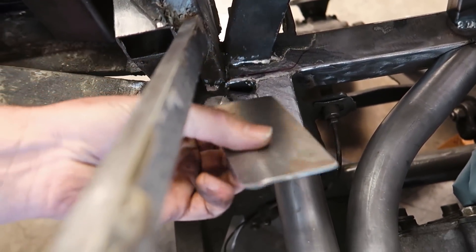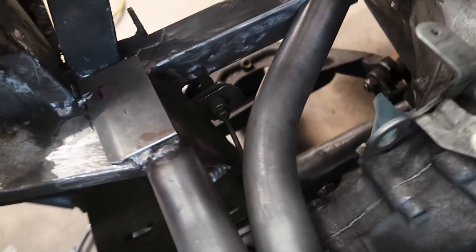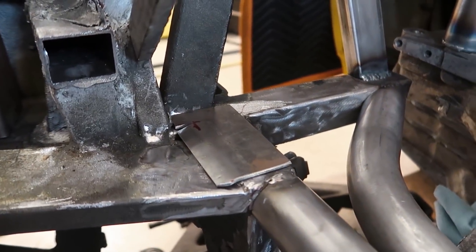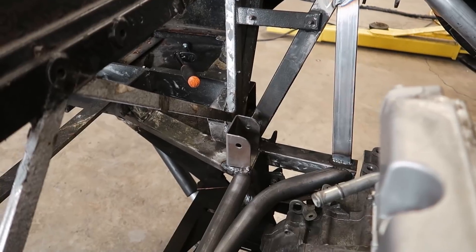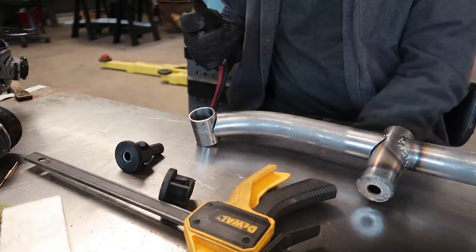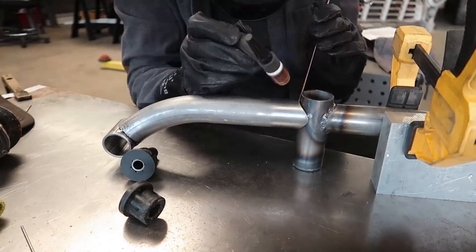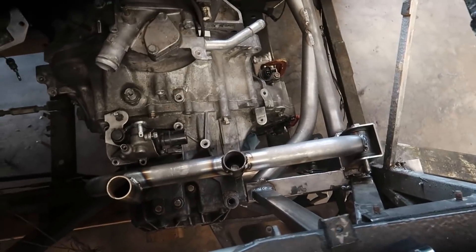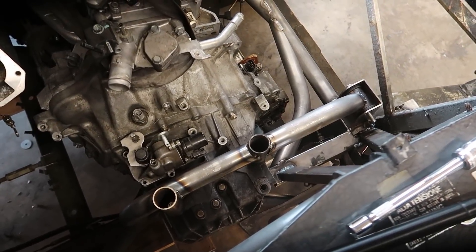You can see where I want to put it — there's an odd hole in the chassis from the way Ferrari built it. I decided to cap over it with some eighth-inch plate to reinforce things and just not have to deal with the hole. Welding this plate in was not fun, but I'm happy with the solution. I fabbed an arm off camera that extends back to that bushing mount, and here it is all welded up and in place — the bracket as a whole is starting to take shape.